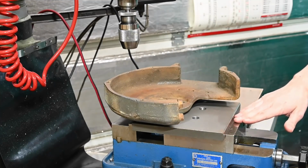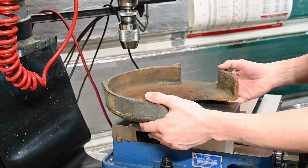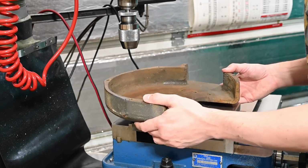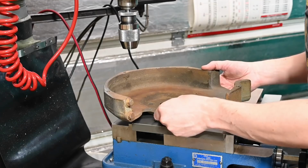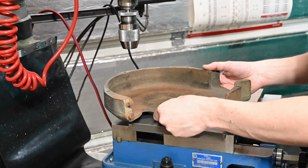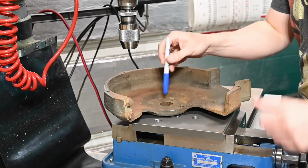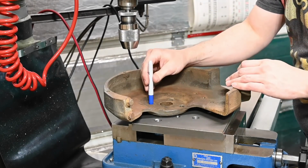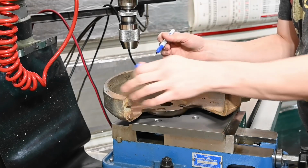So I've got the rear jaw on the vise flipped around. This is not a super, super sturdy setup, but it's way good enough for what we're doing here. And with that big hole, I can send my pilot drill down into a safe place. So I guess if we want to, we can kind of stay in line with the y-axis. Yeah, I guess we can do that. So these holes are 3 inches apart. Doesn't really matter where they go as long as the center bore goes down through the space in the vise, as opposed to hitting the top jaw or the hard jaw.